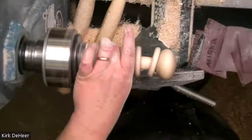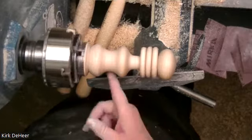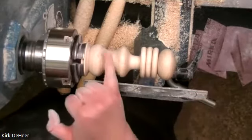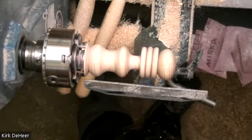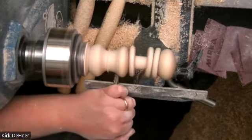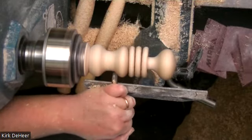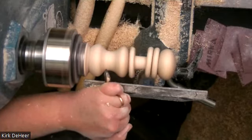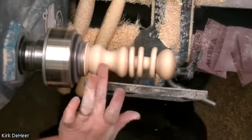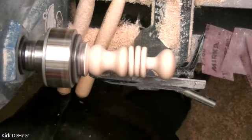I can feel a spot right here, so we're going to stop and look — I'd hate to part this off and have a glitch. I've got a little bit of tear out right here, now that I've gone through all the grits. I'm going to pull my tool rest back up and do a little quick pass over there because we want this to look as nice as possible — feel good in the hands, be soft and smooth. We don't want any tear out. Pick that up, cinch that waist. It's like putting a corset on — accentuate that waist.